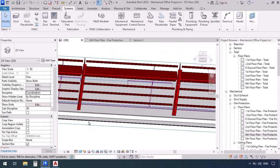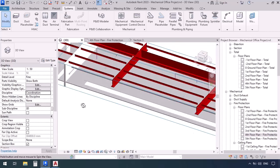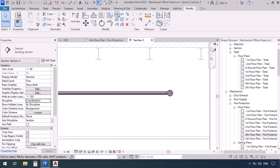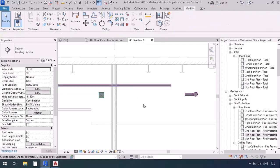Now that I'm drawing this branch — I'm talking about this one — there's no need to have too low of an elevation. I can just go back to the section we had and try to use split. First, we go to the Modify tab, then click Split, then split the pipe here, also delete the unions, and then I'm going to change this elevation to 3900, the elevation we had before.